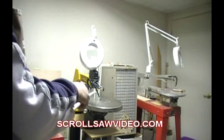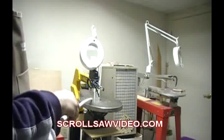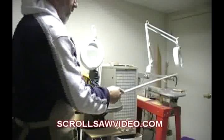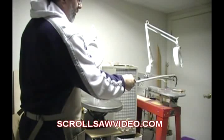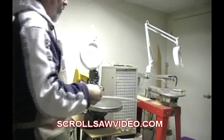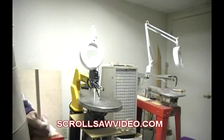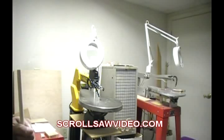You can see I have the Dewalt on one side and the RBI on the other side. The Dewalt, the air blower, when it's turned on, will blow the air this way towards the dust collector. And the RBI, which is on this side, I put the air blower where it's coming off the right side and it'll blow the air this way towards the air cleaner. That keeps a lot of the dust out of the shop and even more importantly keeps it more out of your lungs.